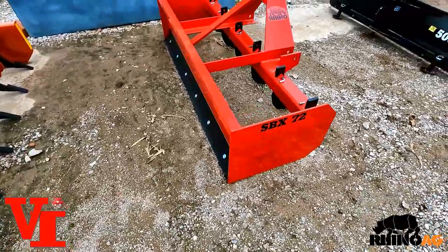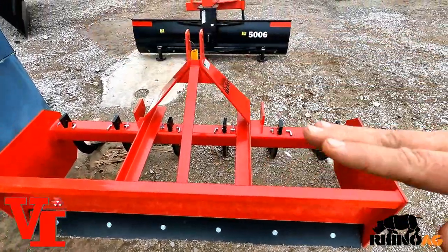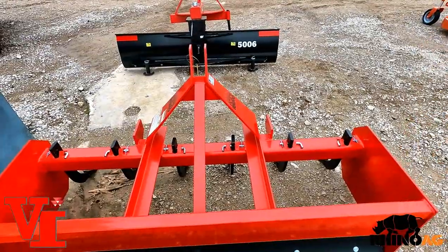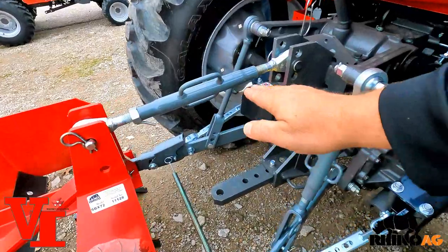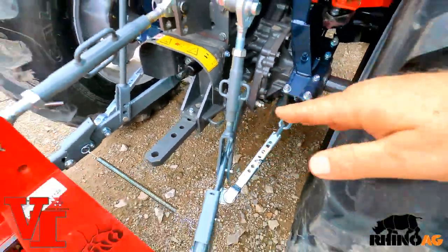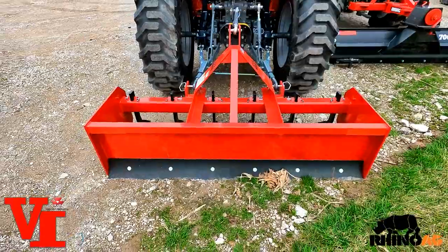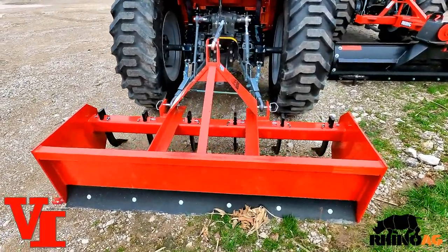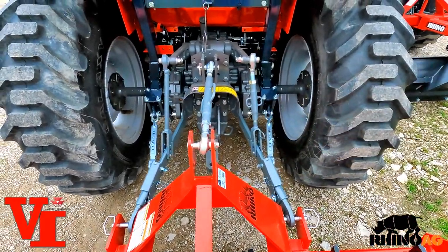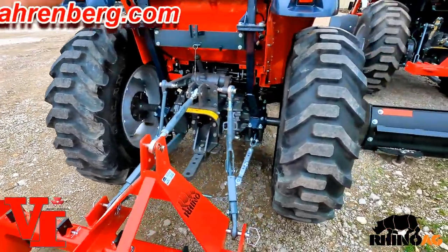It's also a bi-directional tool with grader blades on both sides, so you can work pushing from the rear or pulling from the front. The biggest disadvantage is angling left to right — if you want to maintain a crown in your road so water runs off, you'll have to adjust your three-point hitch leveling rod to tilt it left or right. That likely means getting off the tractor to adjust your top link, or investing in an optional top-and-tilt cylinder kit, which requires hydraulics on your tractor.